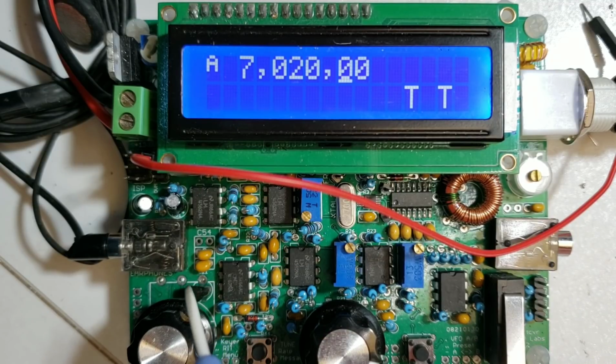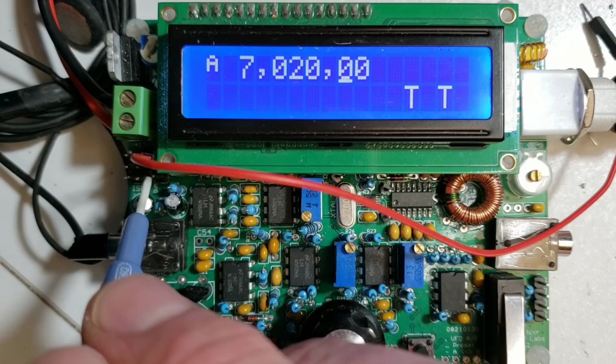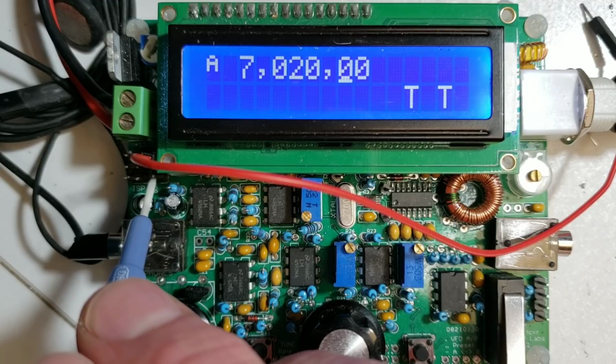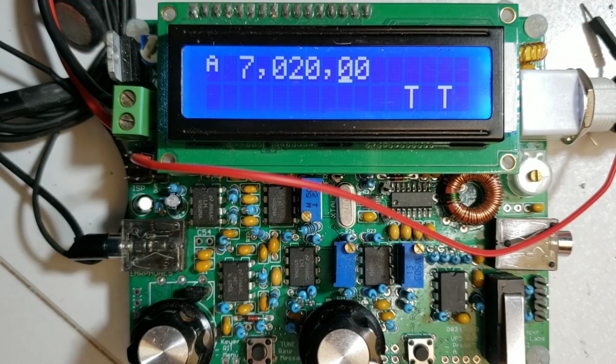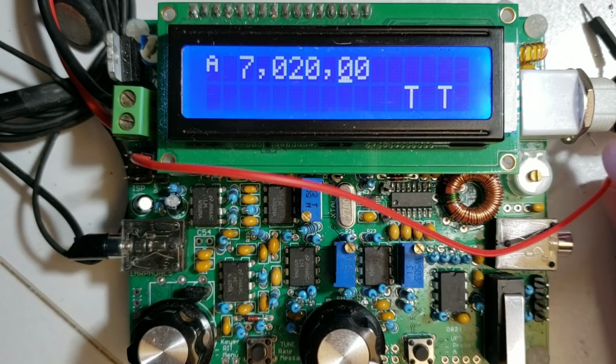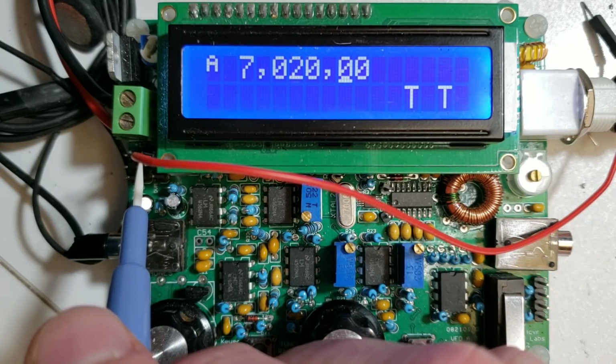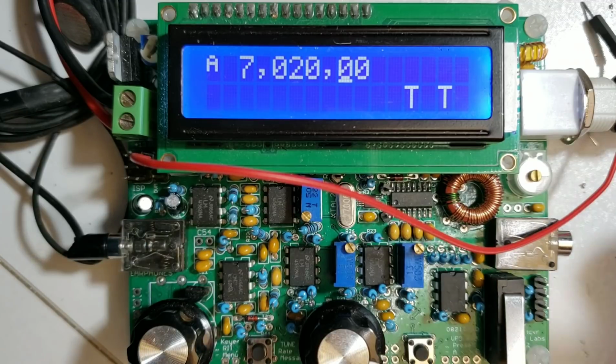Another thing that's commonly misunderstood is the display of the battery icon. It's not an automatic process. You need to actually jumper the bottom of these 3 pins with the top of the 3 pins. So you're connecting the DVM input here at the bottom to the 12 volt side at the top of the header.